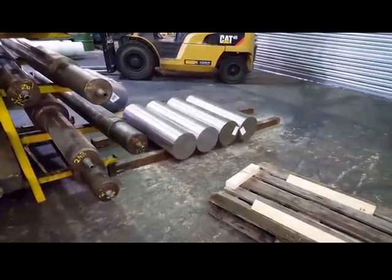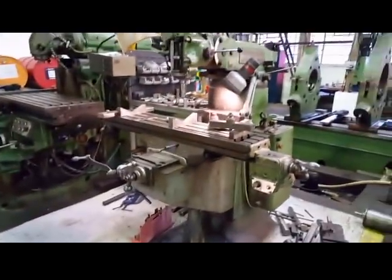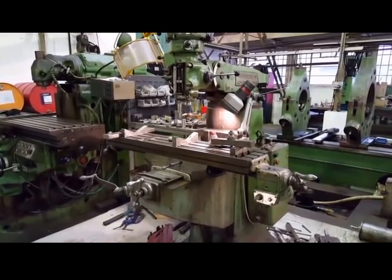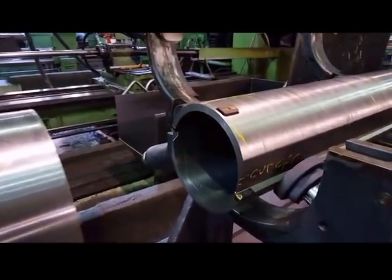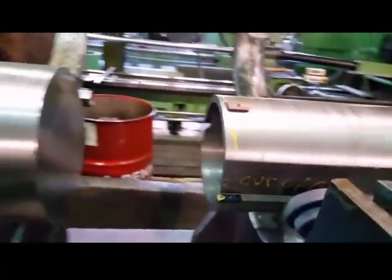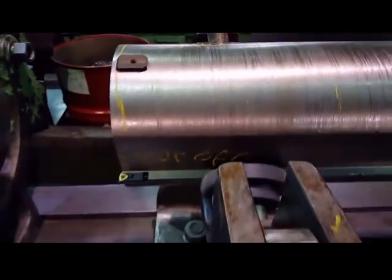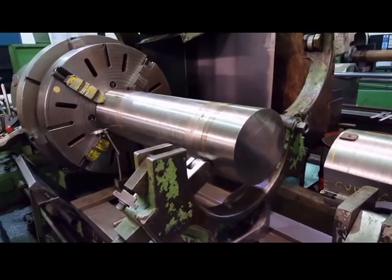What I've got to do now is, I've got four pieces of Inconel 718 for a 9-inch bore, and that's quite a long running time, so I've got time to get on the bridge bore and get on with the head. Well, I'll get round to that head eventually, but this 718, I've had to refurbish this tool first. New cartridges and the Tufnol support pads for the Inconel 718 jobs. Remill, cut off. Anyway, that's done. I'm going to get this going and I'm definitely going to get on with the head.